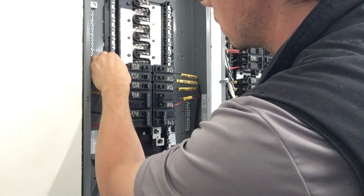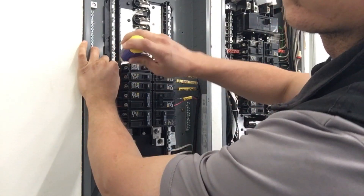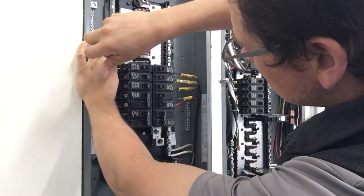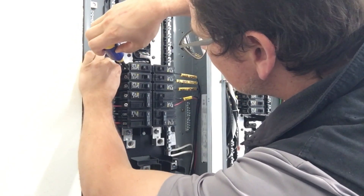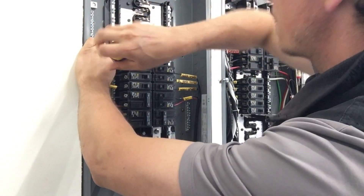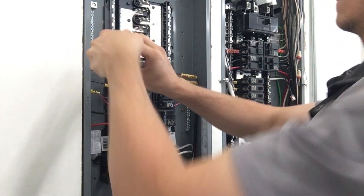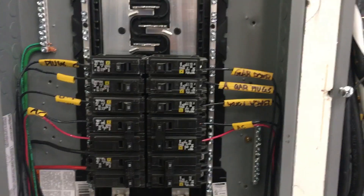If you are the one who wired your critical load panel, you know that, and you can go move that circuit back out. Or maybe you realize three or four months down the road that the outlet on your porch isn't on the critical load panel — well, now you can go pop the covers and move it. This is a straightforward and easy process, and the fact that it's repeatable and all the parts are on the shelf at Home Depot means a DIYer can manage most of the time. And that, my friends, is how you move circuits into critical load panels.